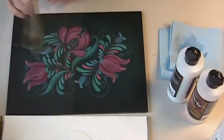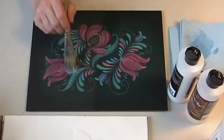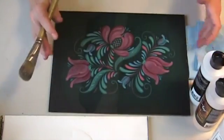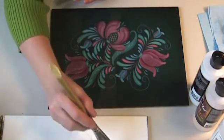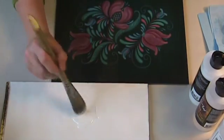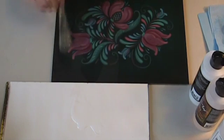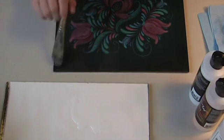A lot of long strokes. You don't want to do this with varnishing little strokes. Okay, you want to do long, even strokes. Okay, but if I'm doing a big, long piece of furniture or something like that, right? And I've got to have even, and I've got to have brushability and all that kind of stuff. What you can do is you can mix your extender into your varnish, because the mediums are all compatible, and now you can put that on there and the leveling time is going to increase drastically.